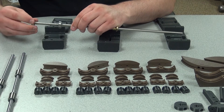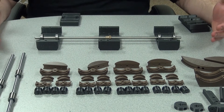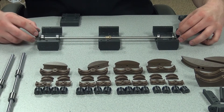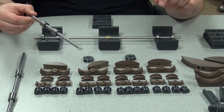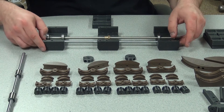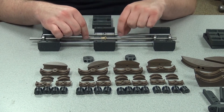I'm not doing this with any kind of instructions — I just figured I could figure it out. These two pieces here are little stops; they go on both ends to stop the lead screw from floating around too much. Next are the bearings. I have already greased these and moved them around — they feel good. That looks like the bottom all put in place. You've got the two rods with the bearings and the central rod with the lead nut.